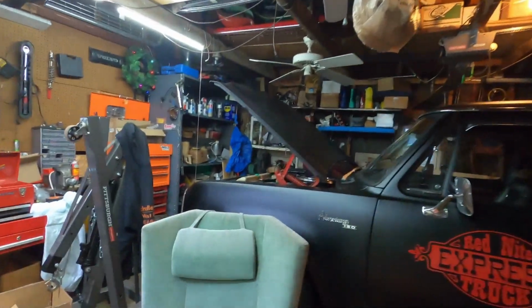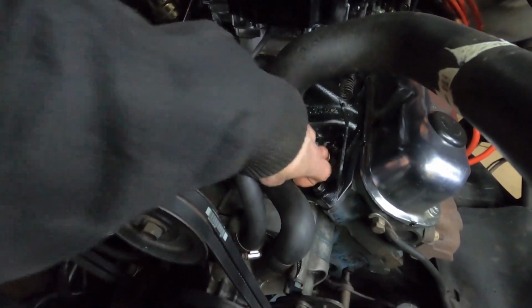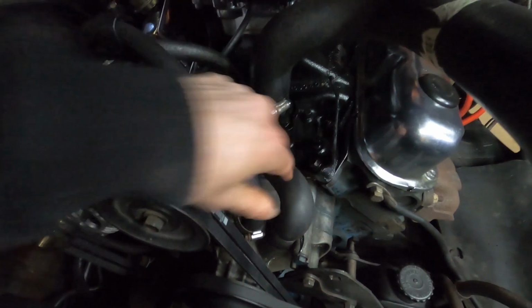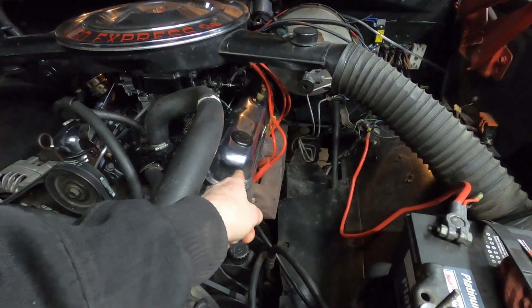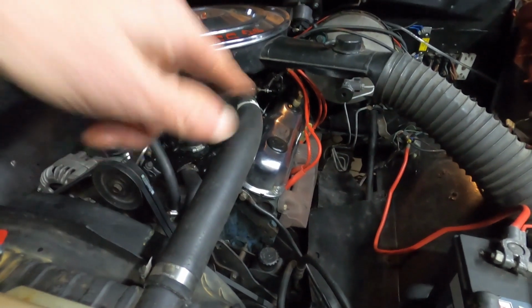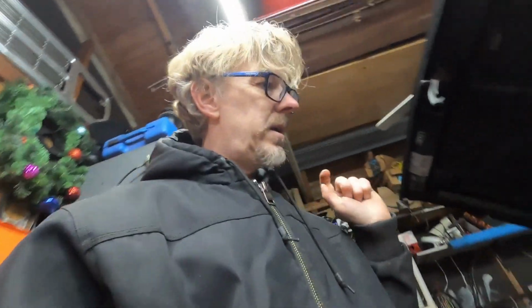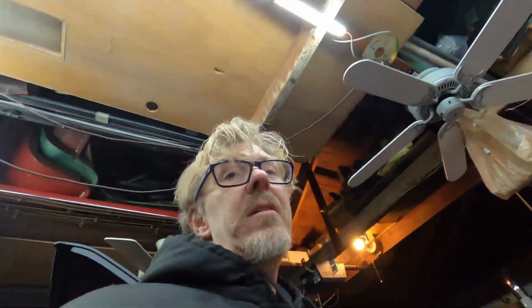because I'm going to put the gas tank in, and then I'm also going to pull the valve covers and pull the lifters, check them for any weird wear, because again, I used used ones, and I'm getting some leaking from probably this, maybe where's it coming from? Maybe I'm not getting any leaking anymore. Maybe it's all better. But I'm going to check the lifters for any weird wear, and then I'm also going to mark the push rods and verify that they turn when the engine's running. Then I'll be secure in my confidence that the Red Knight Express is what we're taking to power tour. That engine's not good.